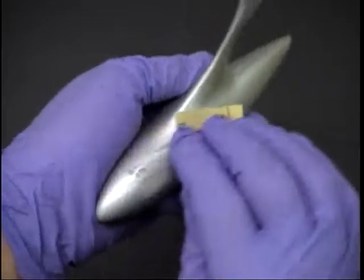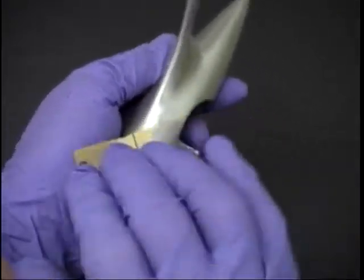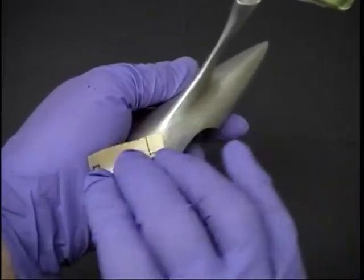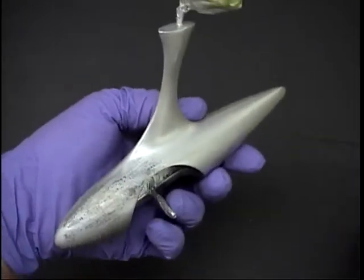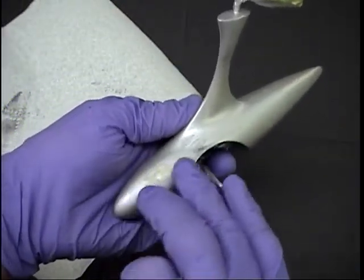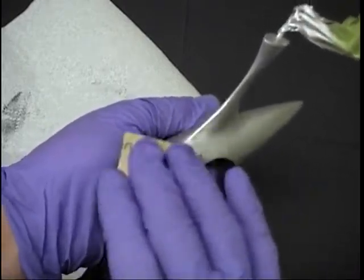And if you're doing an untissued surface, you're going to get these spots where, for whatever reason, either there's a fingerprint there or something. And if we paint over that again, we're going to ultimately wind up with what amounts to be a bubble. So the first thing I'll do is sand this down. I want to identify where these spots are. Now, since it's nice and smooth there, it's not much of a problem, but I still have to seal it.